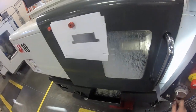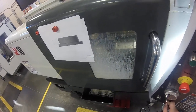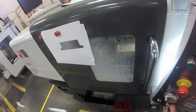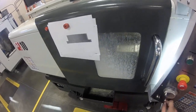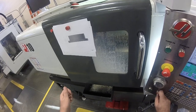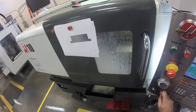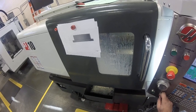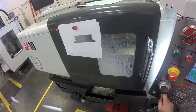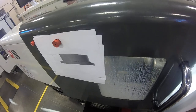This drag bike motor should be done by tomorrow, and I want to have it in the chassis and running hopefully this weekend. This is part of a support plate system because I have a 29-by-11 tire on the back of the bike — 11 inches wide — which requires an offset sprocket so the chain will clear the rear wheel. This support and bearing are supporting the transmission sprocket at its extension, bolted onto the frame. Hopefully everything is nice and straight and that launches.